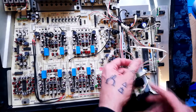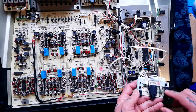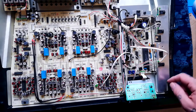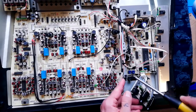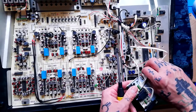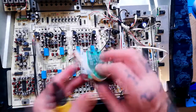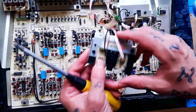This little door board — I already removed a couple of screws because I was trying to figure out where to unplug it — that's got our remote control input and your headphone socket, which is the very loose one. Since I started to unplug that one first anyway, I'll continue with that. You can see there's a common ground wire connected to this big metal chassis bit here, so I'll just unscrew that. Then we've got a ribbon cable — I'll pull it out just diagonally down to the left from this big integrated circuit. I'm definitely going to want to re-solder that headphone socket.